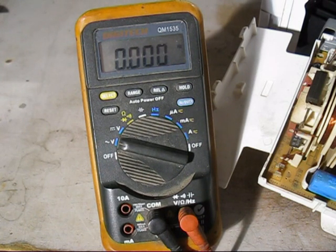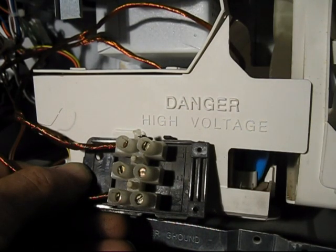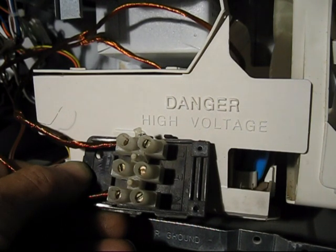So 30 kilohertz means it's good for an induction furnace. If you want to run a small induction furnace and the frequency is a lot lower than that, it won't heat up properly. So we're good to go for the next step. I put the inverter back into the microwave oven and put the covers back on again, because you never run them without the cooling fan cooling it down, otherwise it'll overheat.